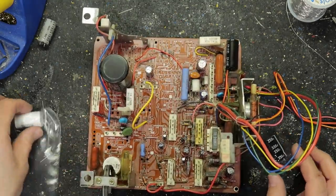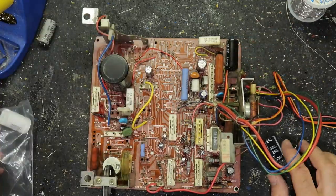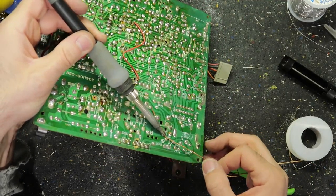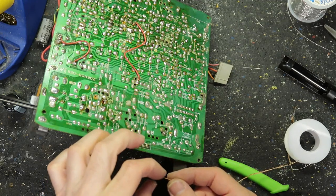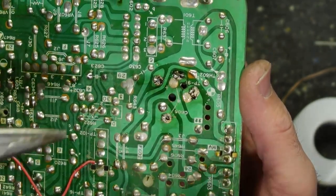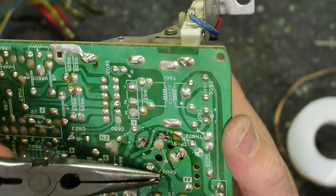This big fat cap here — I did buy a replacement from Ian — it's 330 microfarads 250 volts, going in there. And this one is 1600 volts 0.1 microfarad, which I'm pretty sure is the one for there — so we have one, two, three, four connections there. Works better when you rub just a little bit of flux on the wick. These pins — two or three of them are bent, so I have to bend them back. They're done that way on purpose, so you have to bend it back and align it with the slot or you'll never get it out.